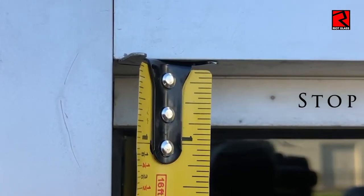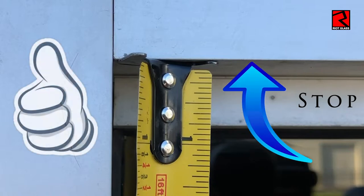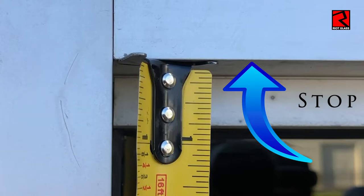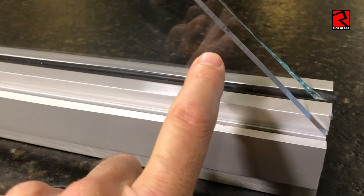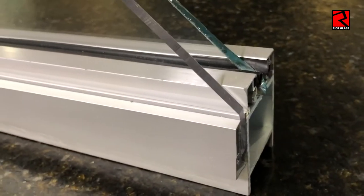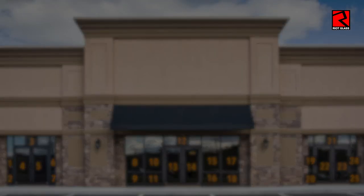Above doors we often see a transom window that has a stop like this. You want to measure all the way to the outside frame. If you measure just to the stop and we're doing a full frame mount, your panel is going to end up being too short. Now the transom window stop is different than the door stop, so I don't want to confuse that issue. We'll show you how to measure a door in the next video called 'How to Measure a Door for Armorplast.' If you don't have any doors, you're now ready to upload your photos and forms to Dropbox. If you do have doors, proceed to the next video to learn how to measure a door for Armorplast.